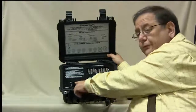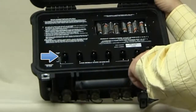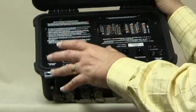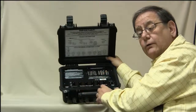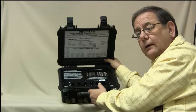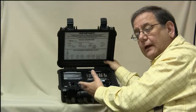The talk group switches allow you to select, for each connected radio or telephone, whether it is in talk group 1, talk group 2, or disconnected from all talk groups. The talk groups allow you to mix connected devices into subgroups — for example, a tactical talk group and a command talk group, or a fire department talk group and a police department talk group — while also allowing all agencies to be brought together into a combined talk group.